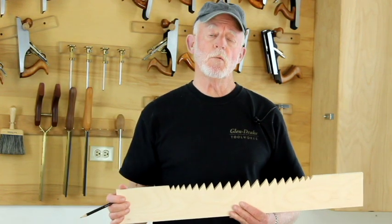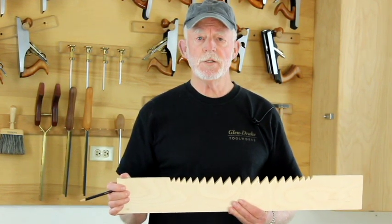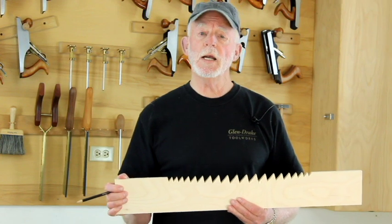That's because when I decided to make a saw, I asked myself why so many people struggle with a handsaw. The answer came to me from looking at how some other tools work. A hand plane, for example, moves before and after it cuts. We move, we engage the blade, we maintain cutting velocity, and the plane moves off the other end. A power saw moves before and after it cuts. You would never put a piece of wood into a table saw blade and then turn the saw on, and you would never turn it off and keep feeding the wood. But that's what we do with a handsaw all the time. We grind to a start and grind to a stop on the teeth.